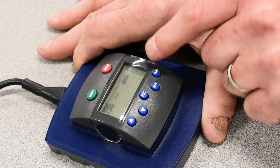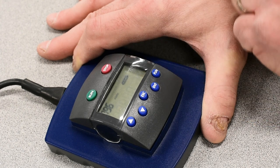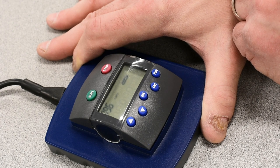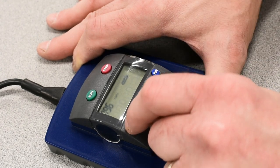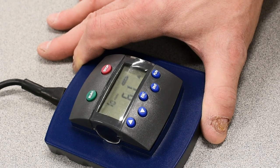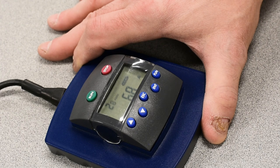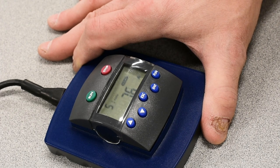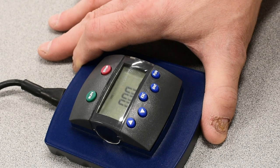Notice, in this case, the word WARN showed up on our screen. This can happen when using the small ZBA71 motor. To get past the word WARN at this step — which usually won't show up — enter a 1 as a command to continue anyway. The ID run is static. You will hear noise coming from the system and the motors. It will take about 3 to 4 minutes to complete. The screen on the keypad will return back to the normal default at the end of the ID run.